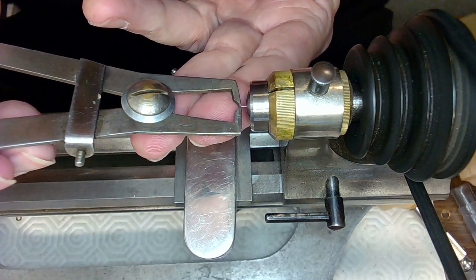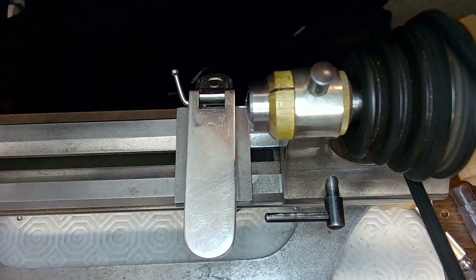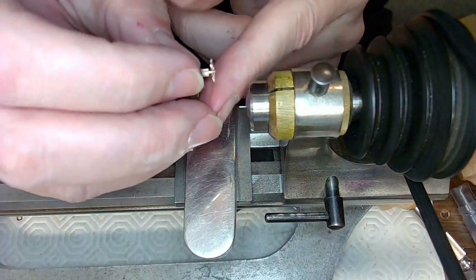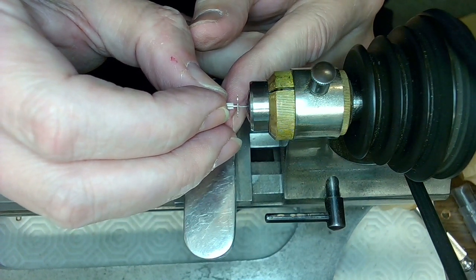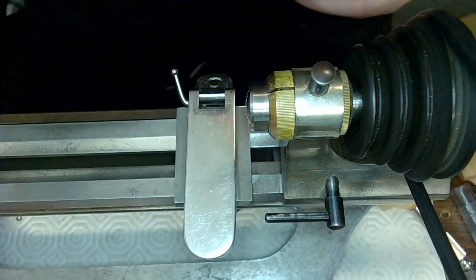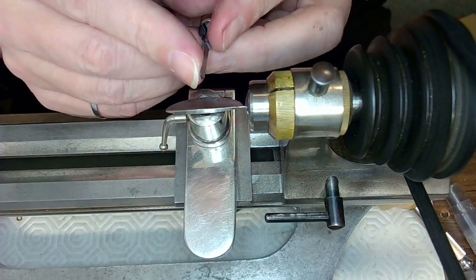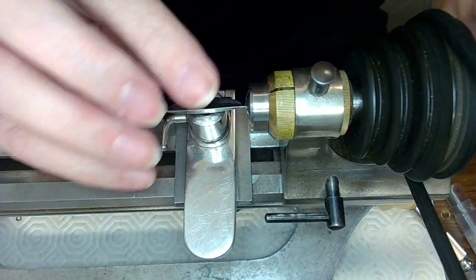See if I'm getting close to 2. And I'm almost at 3. But I really don't know how big this hole is. That's the jewel hole I'm looking at, the other side. So I'm going to check this out for a second. It's getting close to fitting, but it's not fitting yet. So I think I might stone it. Well, maybe a few more turns. If I fail, I've got to start all over again. That's a pain in the butt. But it looks like it's wider on the tip here.